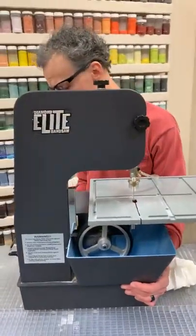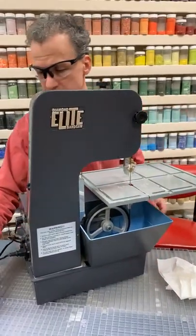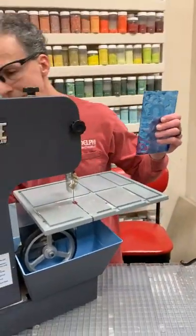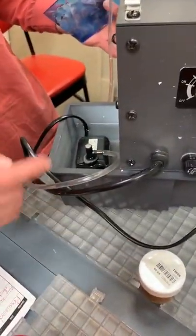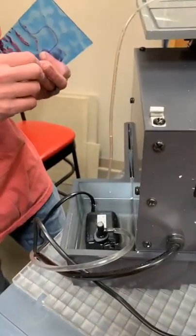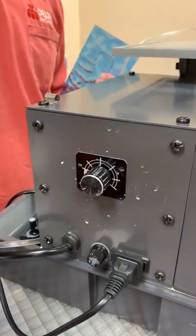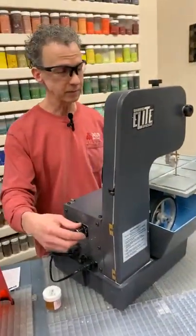The key tip with Mark Stay is to draw your line, let the marker fully dry for a few minutes, then apply the wax and let that set up too before cutting. If you put Mark Stay on right away before the paint dries, the whole line can pick up and float off. Give it time to dry and it sticks much better. Now let me show you the Diamond Elite, which has some nice features.